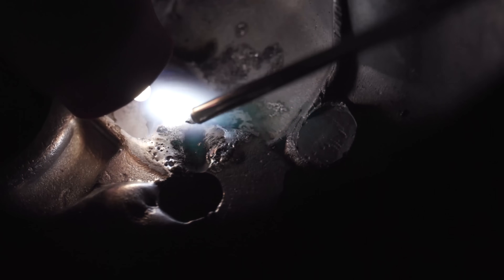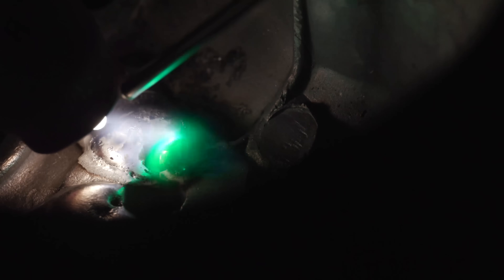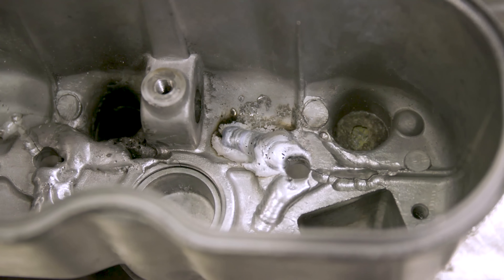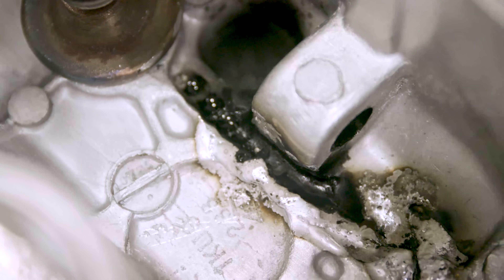That's what cast looks like. As you can see, there's oil coming out — it's a diesel engine and the oils are very dirty. You can see the weld we laid; it's getting hot so I'm going to let it cool. This is how dirty cast aluminum welds. We're going to wait about 10 minutes — if it's too hot to touch, keep waiting. This isn't a critical weld; we're just trying to stop the oil from coming out the top of the valve cover. Using 5356, just dabbing in there, working back and forth, letting the clean metal wash into the dirty aluminum.